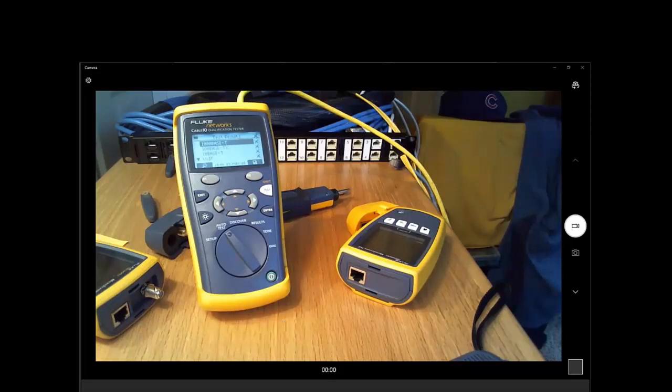Right. Okay. Here's another question. What range of network speeds will the microscanner PoE report? Will it go all the way down to 10 megs? I'm pretty sure it will, but Jim, I don't think it showed up when you demonstrated it. It didn't show 10 megabits because my 10 gig port doesn't offer 10 megabits. Of course. Starts at 100. So that's a fun feature. But yes, it will do 10, 100, 1,000, 2.5, 5 gig, and 10 gig it will identify.